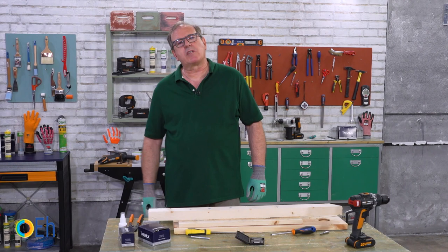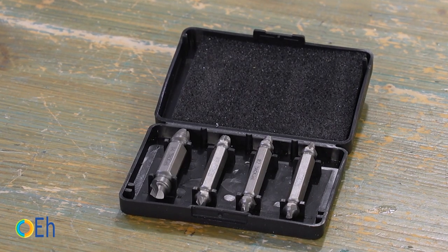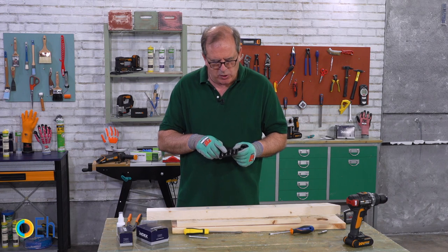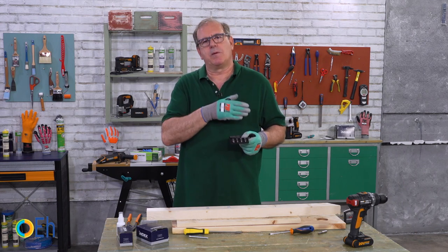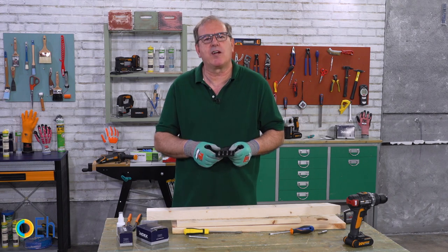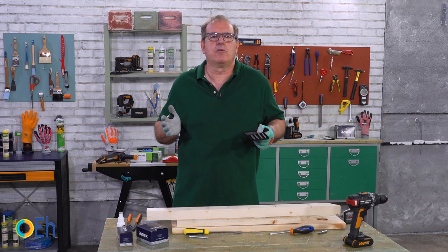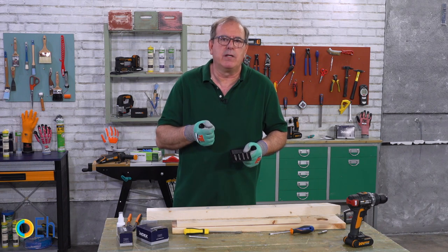These screws are going to be removed with this accessory which is a screw extractor. In general, what I've seen in videos from our colleagues on YouTube is that sometimes it works and sometimes it doesn't. In this case, I think we can somehow help the work of these extractors by doing one thing that is not usually done — that is cooling the bit. As when we work with any other metal piece, this can be a good idea to improve their performance. We leave you the link below in case you want to take a look at them or buy them. They do not tend to have a high price, and the steel they are made of is not spectacular, but it simply serves us for occasional jobs. That's why we can refrigerate it and see if we can make the extractor work better.